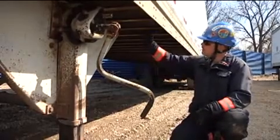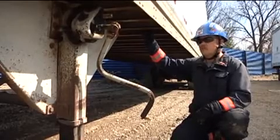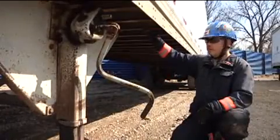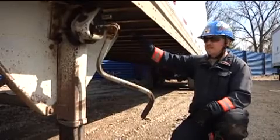Above the dollies, let's take a look at the floor construction. The floor of the trailer is the most stable part. The floor joists run anywhere from 10 to 18 inches on center. When we stabilize — building a box crib from the ground up to the underside of the trailer — this is exactly where we want to capture our points of contact.